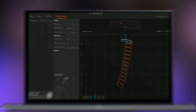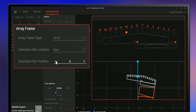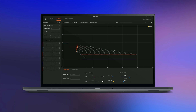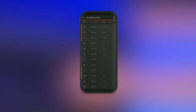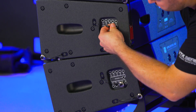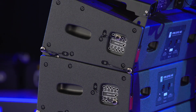This information and the correct shackle position can be found in your array configuration from the JBL Line Array Calculator software. To calculate array angles and get rigging information, we use Line Array Calculator, and to get these numbers in the field, we transfer the information to the ArrayLink mobile application with a QR code. All inter-cabinet angles are selected while the system is on the ground, and the angles for all cabinets can be preset while sitting in the vertical transporters before the array is suspended.